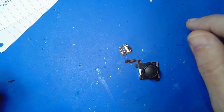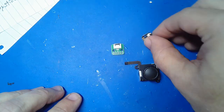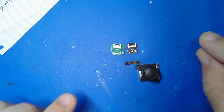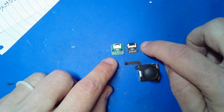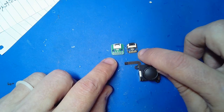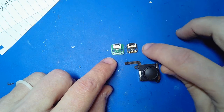What I did in collaboration with a friend of mine is develop this other breakout board, which is similar to the Four Layer one. It is bigger and the soldering points are further apart, because I found when I was assembling joysticks with the Four Layer board the connections are really pretty close, so it takes some pretty careful soldering — which is great if you're looking to minimize the size of things as much as possible.